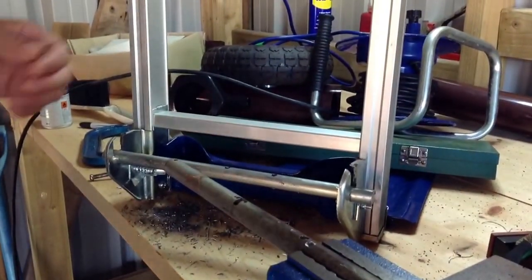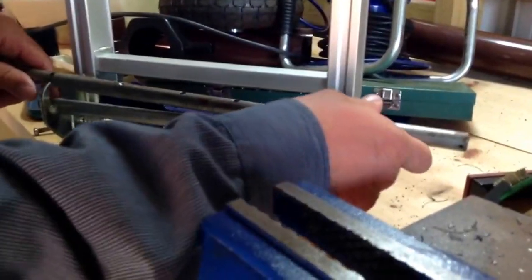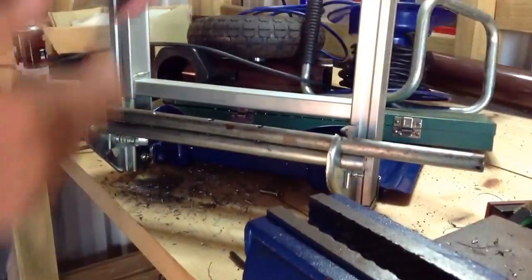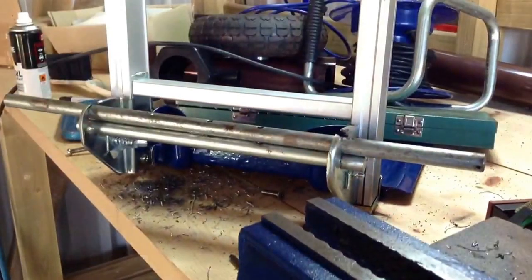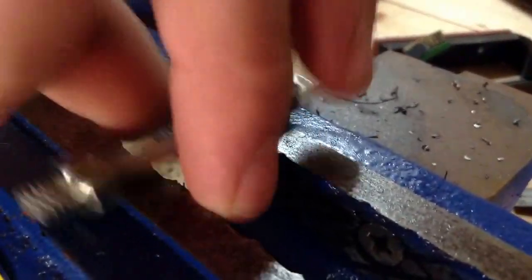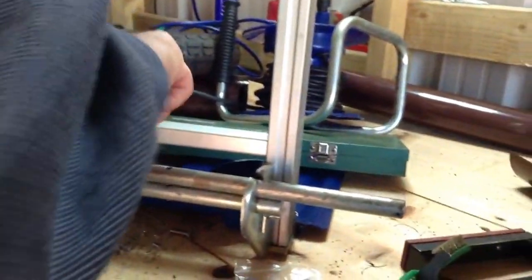What I'm then going to do — if I just take this out of the vice for a second — we've got a drill and tap. We're going to drill and tap the shaft. Let's get it in line and just show you what I've done. Basically a bolt — which I've got over here — these are stainless steel, 50mm. These are going to go straight through the two shafts. So effectively we're piggybacking — we've got two shafts — and we're going to bolt this solidly.